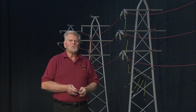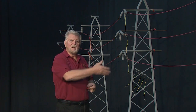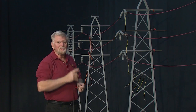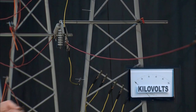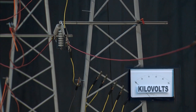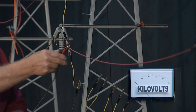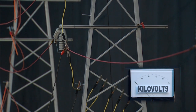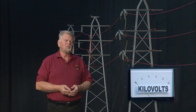To represent the worker and determine whether this grounding is safe or not, my three-phase grounds have been installed, the prop is energized at a single-phase energization. I place the meter clip with a black lead representing the worker's feet on the structure, then place the red lead representing the worker's hand on the bottom conductor. As you can see by the reading on the meter, there is no potential difference across the worker. We felt that the worker was safe on this structure to perform their work.